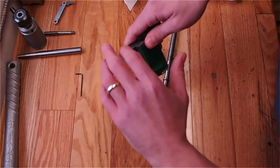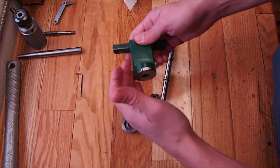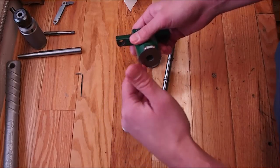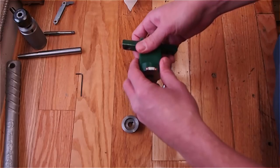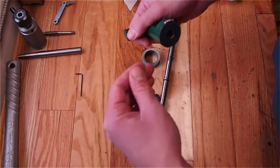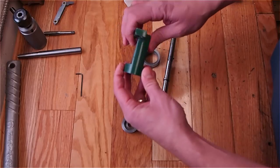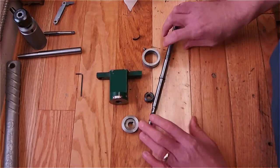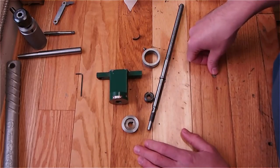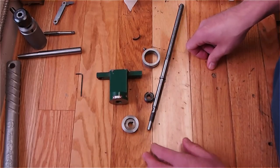The biggest downside to this is deep groove ball bearings, although they can take axial load, you have to be really careful that you don't overload them axially. They're more designed for radial loads, but you can load them axially. That's the deep groove portion of ball bearings. The deep groove allows you to apply axial loads to it. So I'm going to do that because I think I can fit that all into this assembly without having to extend out the lead screw. And hopefully that'll be a much smoother assembly that's more of a joy to use. So let's sort of get to work on that.